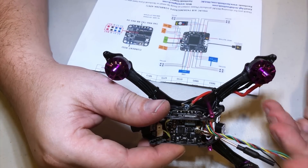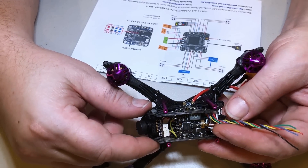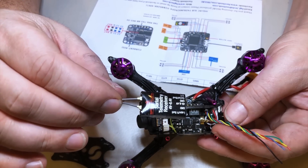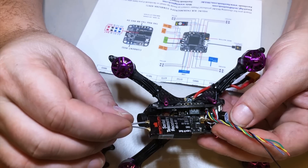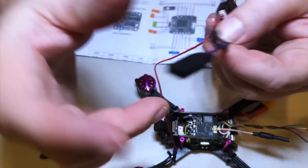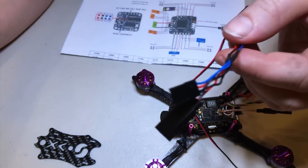What they did is pretty clever - this bundle of wires is so you can hook up both a 3.3 volt receiver, which I'm usually used to, and a 5 volt receiver, which is what this Spektrum is. This receiver requires 4 to 8 volts, so for power and ground I'm going to use the 5 volt red and black wires over by the S.Bus pins. I'm going to cut off what I don't need - it'll be a little extra messy but easier.